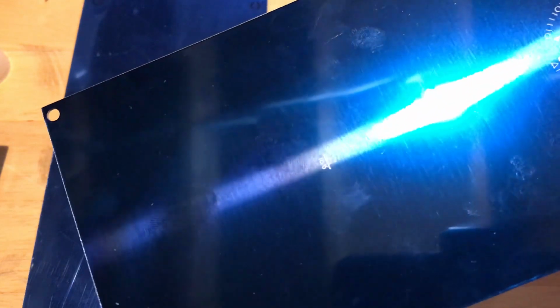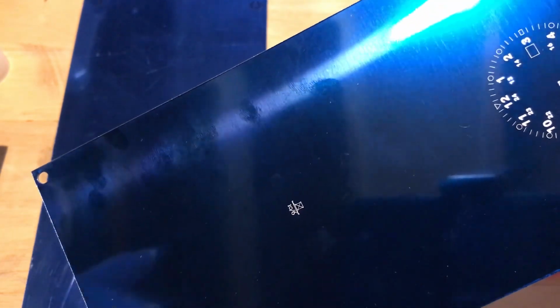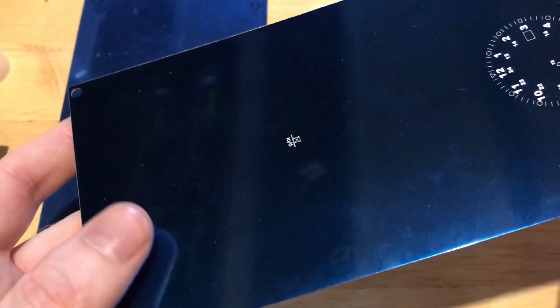If you're going to do this yourself, a lower cost way to get into it would be photo etching, in which case you print out a design on your regular old home inkjet printer, and then you've got to go through this process of placing it over the plate, exposing it to UV light, washing it away, cleaning it. It's a really involved process. If you were able to have access to a laser that could just cut directly into steel plates, then you're going to save yourself a lot of time and headache.